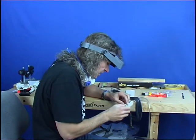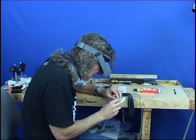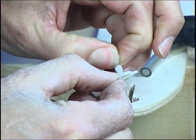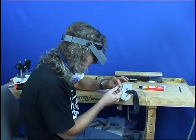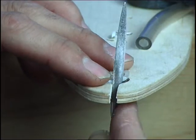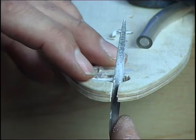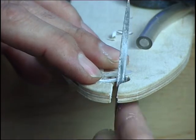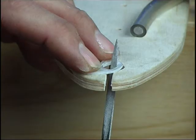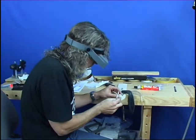What we now need to do is just take off the paper that we glued to the top. Hopefully this hasn't stuck on too strongly. Now I'm going to get a diamond file and just file off the edges. You get some little imperfections where the saw has moved a little bit, so you probably want to spend about five or ten minutes cleaning it up. We've got a curved side to this diamond file so we can run on the inside of these curves. Okay, now we've completed it.